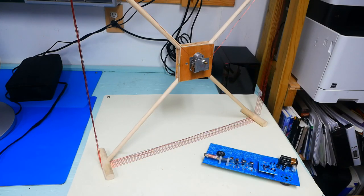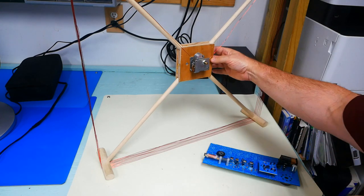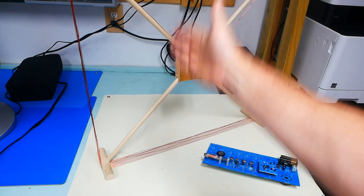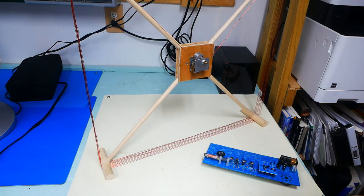Well, that was it. Just wanted to tell you, no more mid-rolls, and a nice little antenna amplifier, DIY type of thing. Hopefully you build one, mess around with it. And you can build them for other radio frequencies, of course. This is easiest for the AM band, because AM antennas are vertically polarized, and this is a vertical system. FM is circular polarization, but you'll still be able to build one a little bit different.